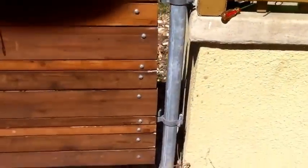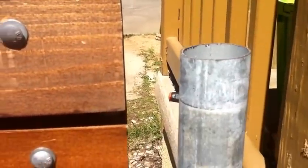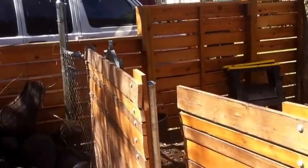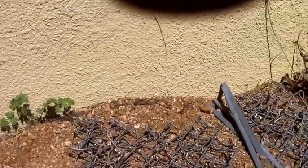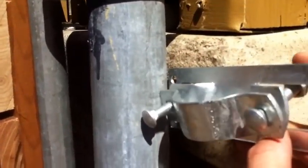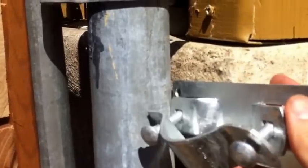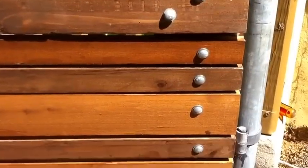Part of the reason this project got started is I used to have two posts on this side but now I just have one, and you can see it really moves around. Even pulling the post back a quarter inch causes the entire fence to lift up and become level again. I've got a bracket that's going to go around the fence pole, bolted to the concrete with galvanized lag bolts so I can wrench the pole back to the correct position using masonry anchors.